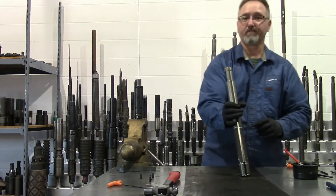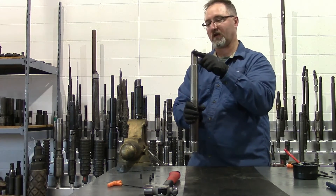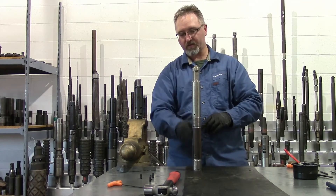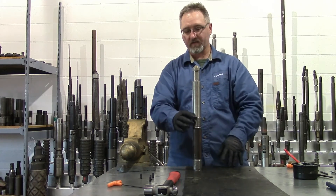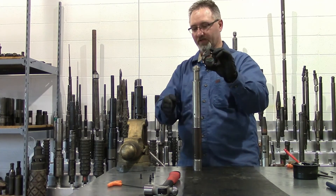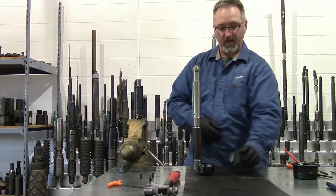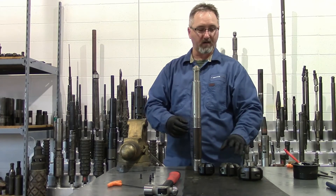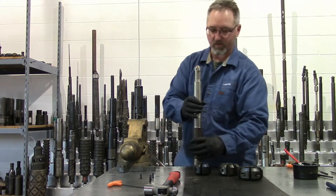Now we install the weight bar. When we install the weight bar, it'll slide over the line through the slot and then be retained on with spring pins. For 2-7/8 and 2-3/8 tubing, the 1.62 OD is typically always good and you don't need to run guides. But for larger size tubing and casings, we've threaded the bars so you can add guide rings to it so when they cut your line it can't fall past your fish. There's a 2.60 or 2.74 size, a 3-1/4 size, and a 3.75 that we typically have on the shelf. Other sizes are available on request and would have to be manufactured, or if you needed a smaller OD, we can modify those in house.